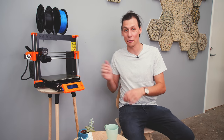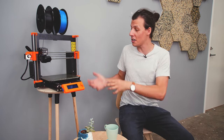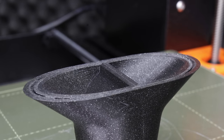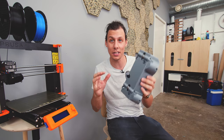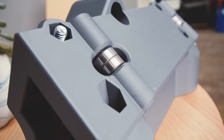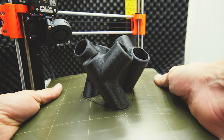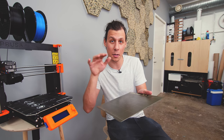Would you look at that — it works as a stand for my new printer as well. Since Prusa sent me this printer in exchange for using it in one of my projects, I just want to give my final thoughts. Quickly summarized: I'm super impressed by the machine. The thing I'm most impressed by is the print quality the printer maintains even on the rougher and faster print settings. This part printed in their quickest setting — although you can definitely see the individual layers, the consistency makes the part look really good. It has cool features like the flexible build plate that prints snap right off, though I did have a couple of prints fail because they weren't attached well enough. The fix is just to use a thin layer of glue stick, which I use for all my other printers anyway — so keep that in mind if the surface touching the build plate is really small.